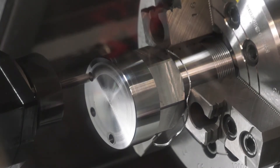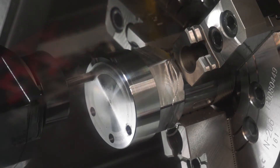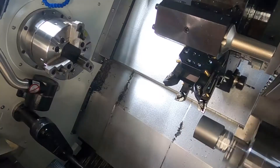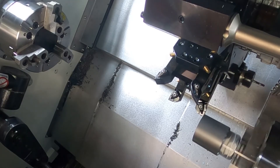And what does the machine come with? On the standard spindle you've got a 200mm three-jaw chuck; on the sub spindle you've got a 150mm three-jaw chuck. You've got a 65mm bore on the main spindle and 52mm bore on the sub spindle, and you've got an automatic tool setting arm for each spindle.